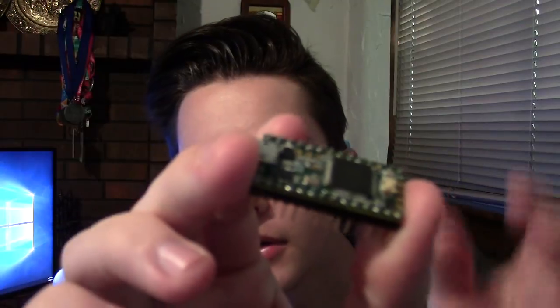Because it was only my second time ever soldering, when I soldered the pin headers to the Teensy, I got a little solder right there on the chip. The whole thing seems like it works, but all the inputs and outputs are fluctuating and no real values are being outputted. So I actually just got in the mail a brand new package — four breadboards because I only have one working one, and a brand new Teensy. Hopefully I can solder this one properly and get everything up and running and finally finish this project.